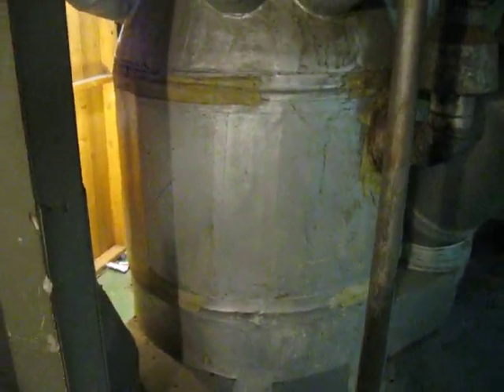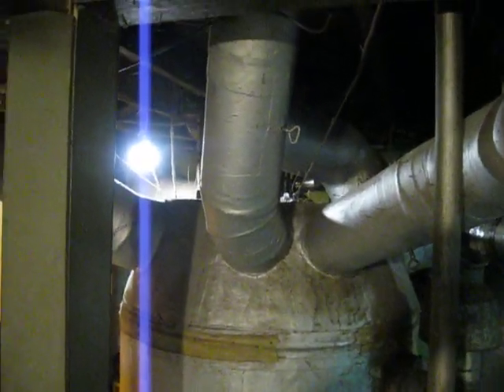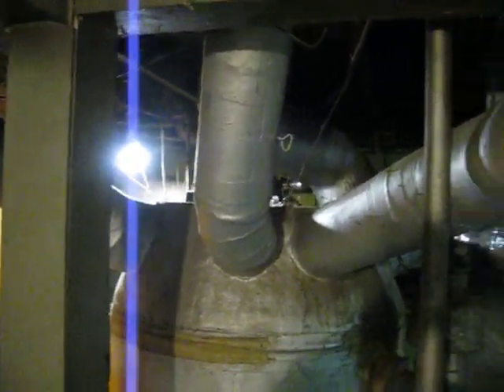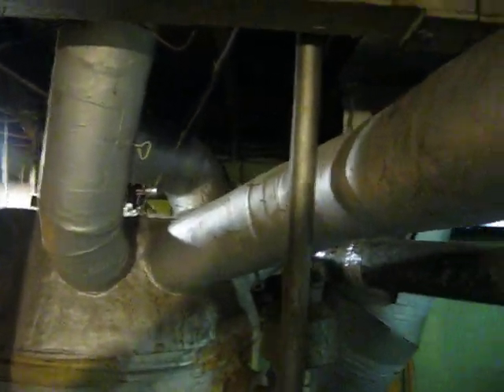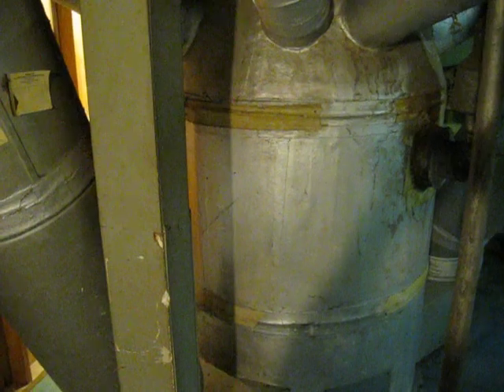It'll be heated up by a big burner enclosure on the inside. The air will flow around the outside of that burner enclosure, which is ceramic lined, and then it'll go up through the rest of the house. As it heats up, air becomes less dense and it flows through all these little octopus tentacle things to the actual ducts, at which point the air recycles back through the house.